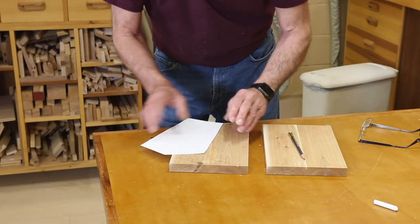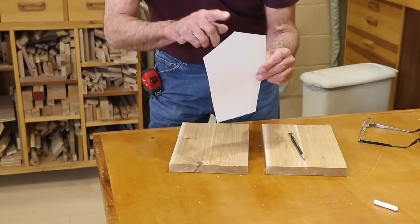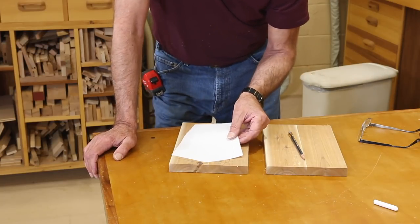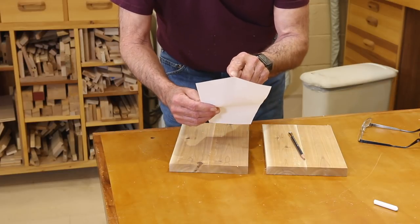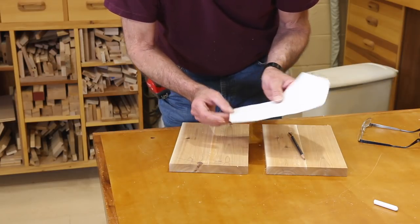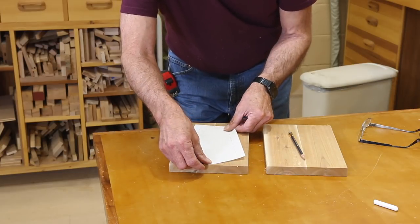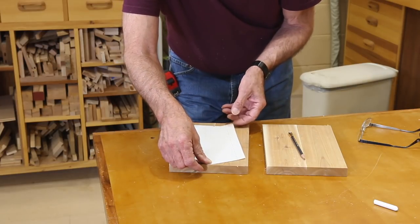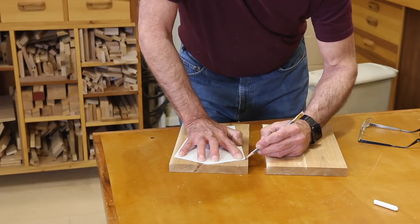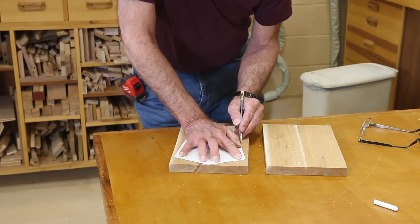I've got our two boards cut to length, 11 inches long. When you download the template and print it, you'll notice it's 10 inches long from the tip to the bottom — part of the reason is because I had to make it fit on the scanner. But it's going to be okay because this is self-aligning. The point of the template is at the top and at the bottom it's four inches across. Mark the center of that four-inch width with a little arrow, then line up the point with the joint between the two boards and the two-inch mark at the bottom with that same joint. It'll be perfectly square. Then just draw around the template to get the outline. We're not going to worry about that dashed line yet — I'll show you what that is in a few minutes.